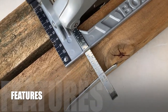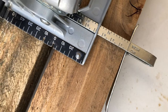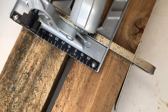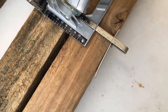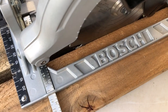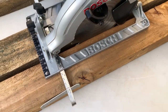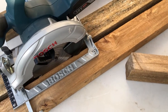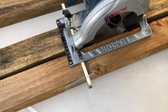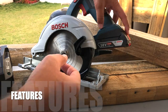Here's a look at the parallel guide — it simply slots into place and is secured on the opposite end with a wing nut. All you have to do is set the correct depth or thickness of the wood you want to cut. The end closest to you needs to be a straight and true surface, otherwise your cut won't be either. This is a good way to use a reference guide on a piece of wood that would otherwise be difficult to cut accurately.